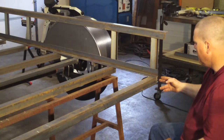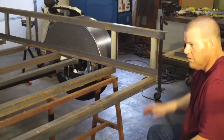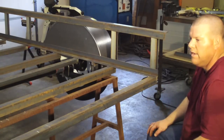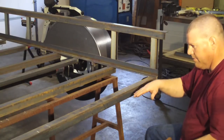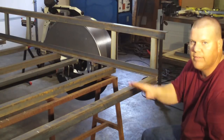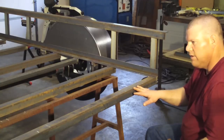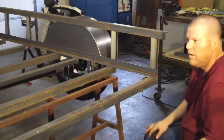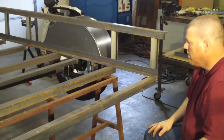There are a ton of ways to do this. I've seen trailers where they just use a flat iron with a hole in it and the tailgate also has a hole — that's your hinge. More power to you; it would work. I choose to go this way because it's stronger, and when we put the ramp on, the angle iron I use for the ramp — this hinge alone is going to beef that up so it's not going to bend on you. I'm going to tack this up, get it onto the frame, and then we'll install the ramp and see how the latch works.